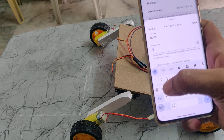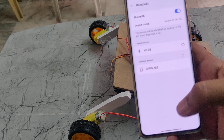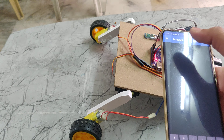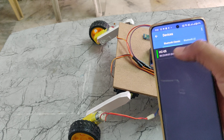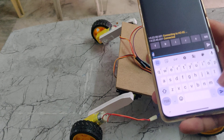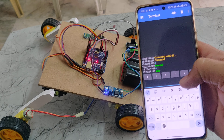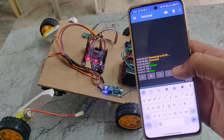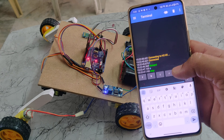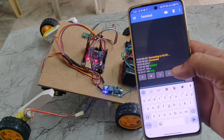The main purpose of this robot is we can control it using the Bluetooth terminal. The Bluetooth terminal commands will be received by the Bluetooth module and those values will be given to the Arduino Uno. The Arduino Uno will then send commands to the L293D motor driver and at the same time send values to the servo motors, so we can control the servo motors. The battery has 4V 1A capacity, connected in series, so 4+4+4 equals 12V with 1A capacity.